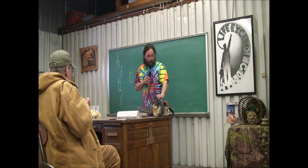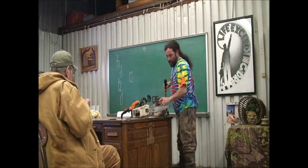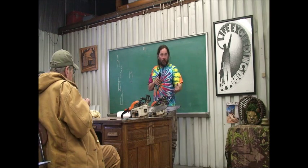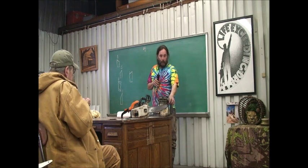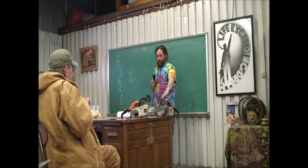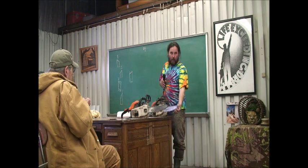So you'll see me running them a little bit looser than, say, Jerry's saw here. That's about the average tension that Jerry runs. It's not going to hurt the bar. Jack runs them a little bit tighter. It's all in your own personal preference. And you don't have any trouble with the chain jumping off on you? The chain looks loose, but there's really not enough slack in that thing for it to jump. I rarely ever lose a chain off the carving bar.